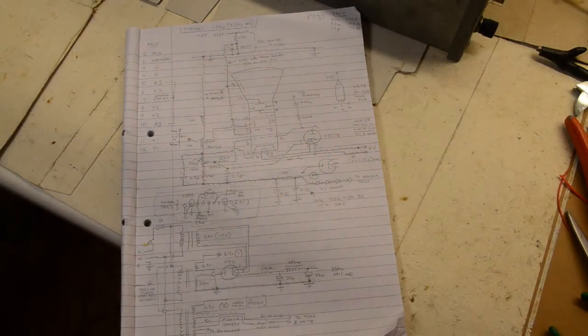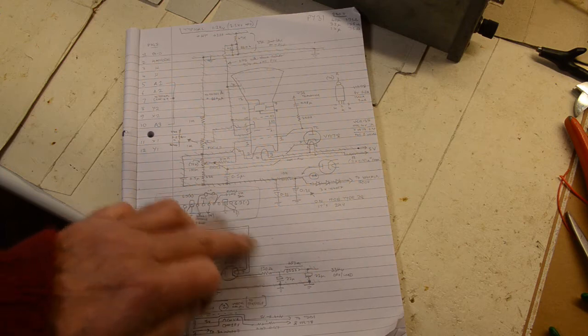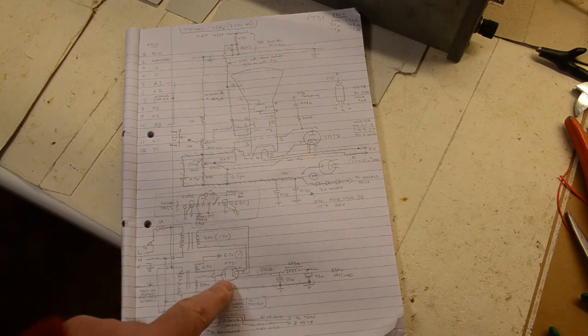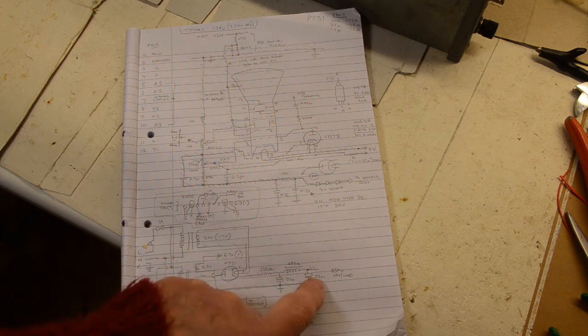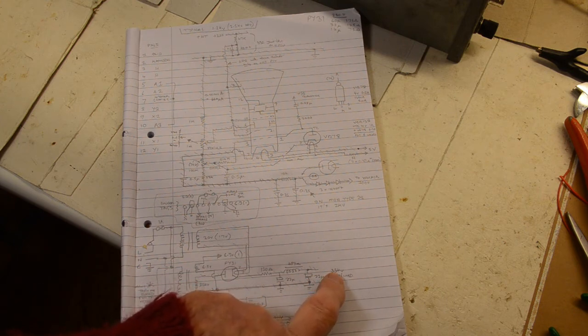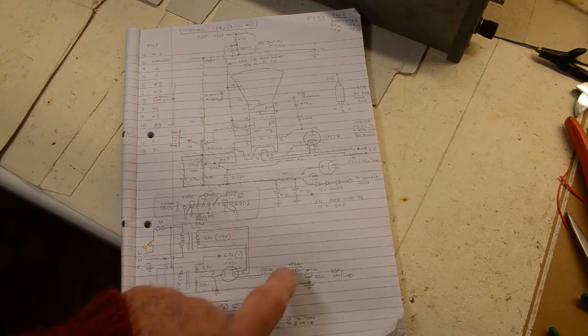This is a circuit which we've completed. Very simple, nothing unusual about it. You can see at the bottom 3 transformers, one as I already explained, which is 17 volts for the PY31 rectifier. That is for the half wave rectification for the currently 334 volts off load. 2 smoothing capacitors and a smoothing choke are underneath the board.